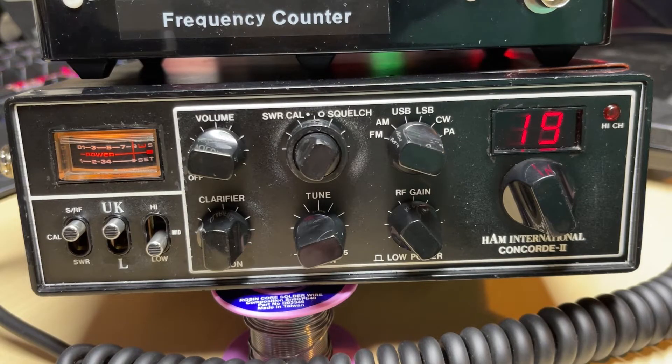All in all I think it's turned out quite well - this modification works a treat. It's compact, there's no need for any tracks to be cut underneath, no messy wiring underneath or precarious placements of any EPROM boards. It's basically: take your PLL chip out, plug it into this board, plug this board in and solder it into the radio, connect your switches up and jobs are good. Obviously changing the VCO as well because you may not get the lower end lock - it's always good to replace that green VCO anyway because they are a little bit dodgy.